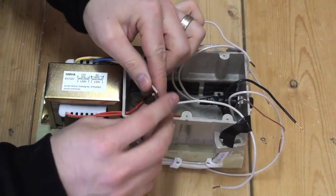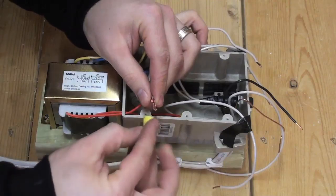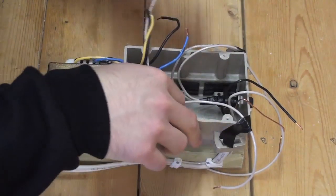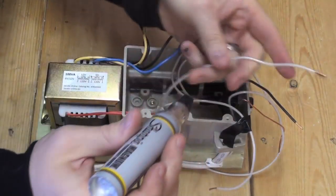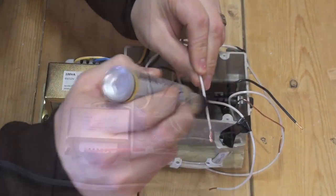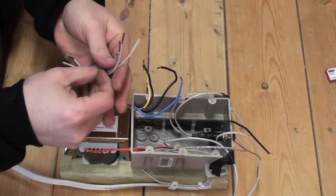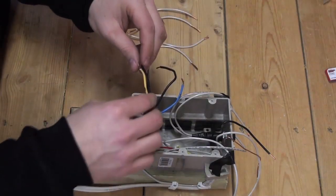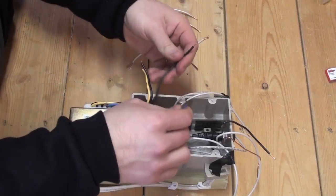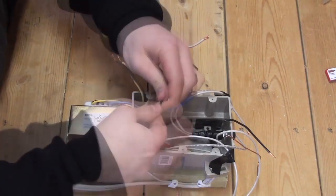Attach another length of connection wire to the positive transformer wire, which will later be attached to the dimmer switch. Bury these wires and place aside for now. Don't forget to mark this as the positive lead with your permanent marker. You will now require 4 lengths of connection wire and 2 additional wire nuts. Take the blue-black lead and attach 2 lengths of wire with a wire nut.